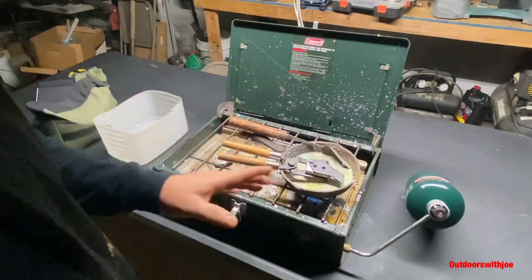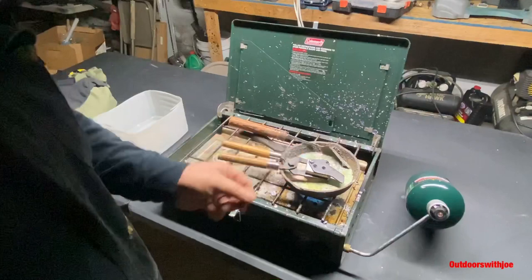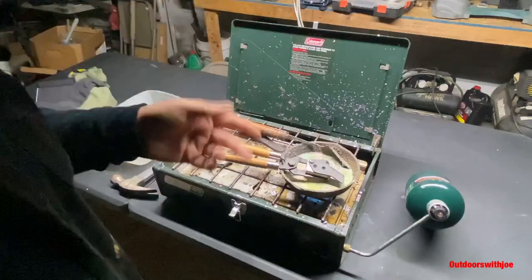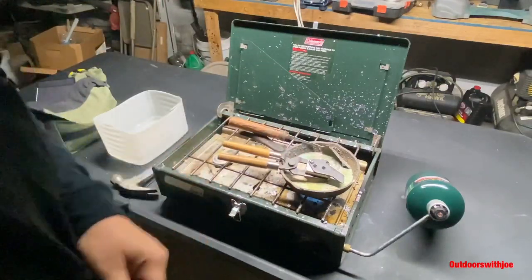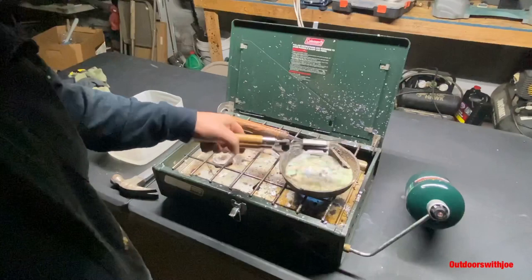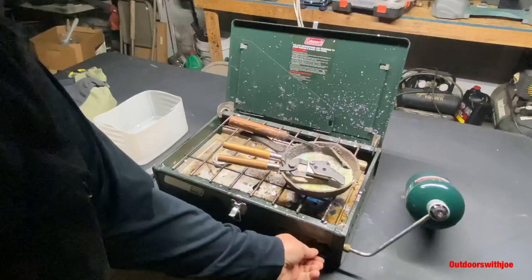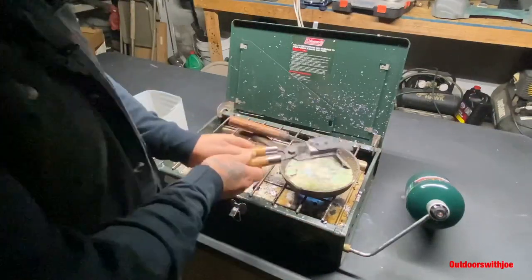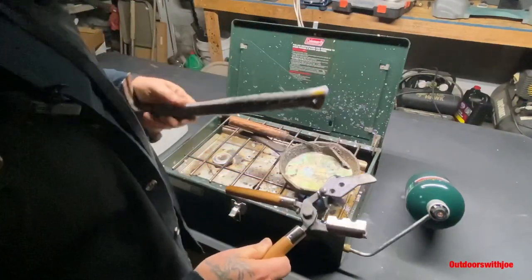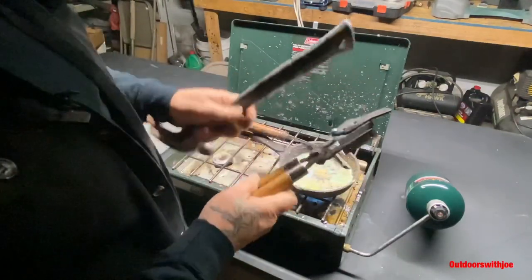Keep your water away from it — keep it a few feet away. You don't want to get water in it and you don't want to sweat in it. Good ventilation — be in a well-ventilated area, open the door, turn on a fan or whatever. I've got my doors open down here and there's a little breeze blowing through. You don't want to breathe the lead fumes — that stuff is not good for you. And you're going to need to get a mallet — a wooden mallet or a rubber mallet. I just use the back end of my hammer, it's rubber, and it works good.